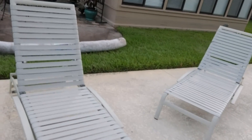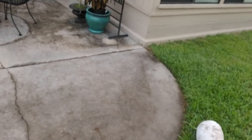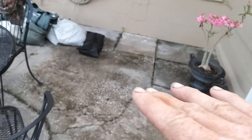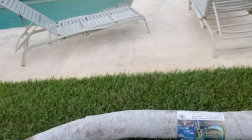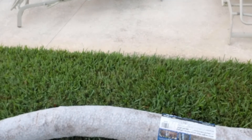They built this pool over here — quite nice — but what it did was it raised up the soil, and now water tends to run from this area back across our patio and ends up in this corner. You can see the sandbags here; this was actually from the hurricane. Water really came through the area. So what we're going to do is put in a French drain — we call it a gravel perforated drain — although we're using newer material, which is perforated pipe surrounded by styrofoam peanuts.